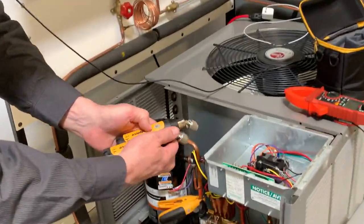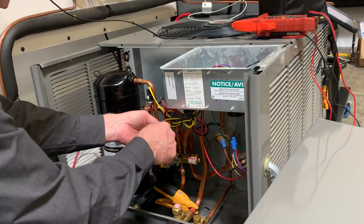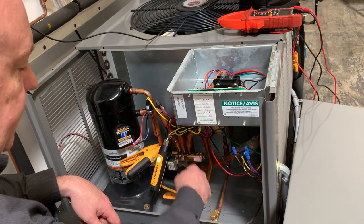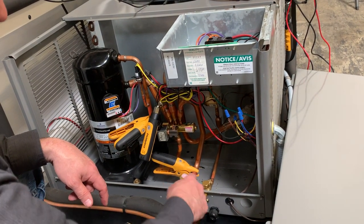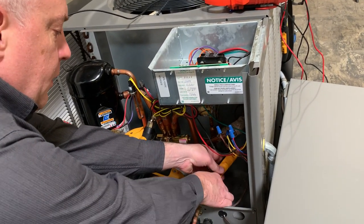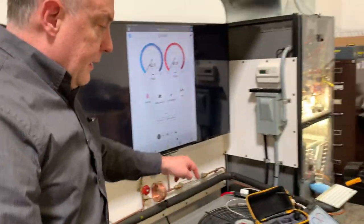Now I've got my high and low pressure probes, so I'll turn those on. Tie this one to the true suction line — this is a heat pump, so onto the true suction, right off the suction line of the compressor. This is what we call on a heat pump the vapor line. In air conditioning it's the same line, but you should always get in the habit of using the one off the reversing valve for any application because that is your true suction. Then I'll hook up the liquid line, and we're just waiting for the time delay to end. Now I've got all my probes hooked up and the condensing unit has just started.